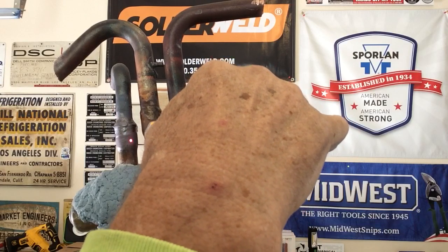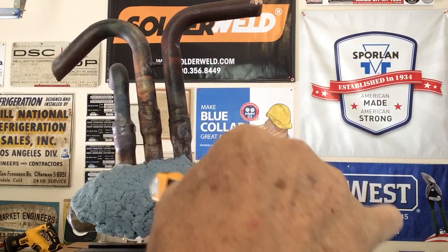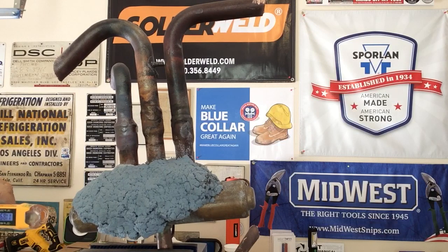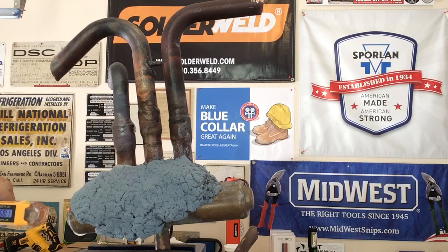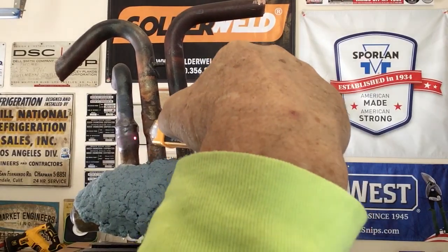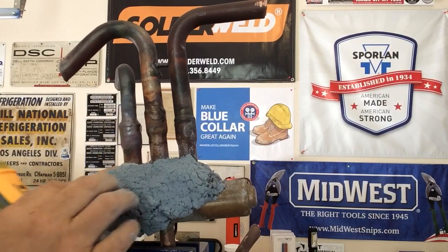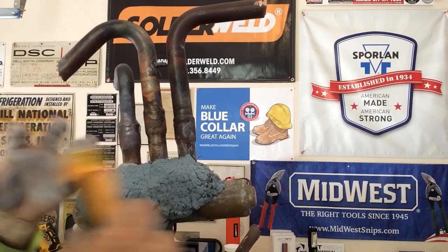We're at 327 degrees and dropping. And the reason it's dropping is this heat absorbing putty is actually absorbing the heat. Here it is, the putty is 109 degrees. The valve is at 105. The end of the valve is at 121. Of course, this is the hotter side of the valve, 118, 118.5. It's dropping, 118.2. And so it's really doing its job. Again, we're at 204, 209, 255, 251, 242. It's absorbing this heat. The valve is hot, but the putty is absorbing all the heat around it, and it's drawing it.